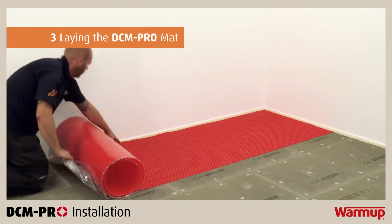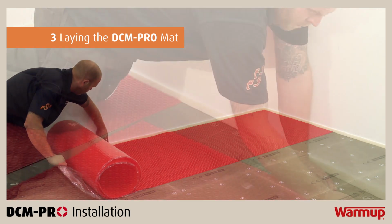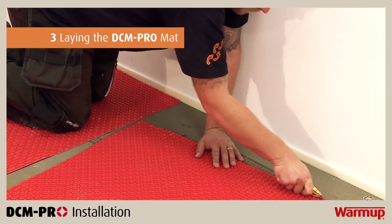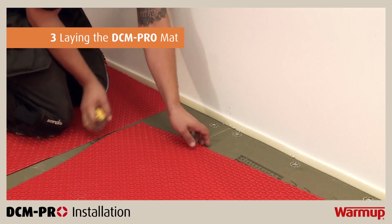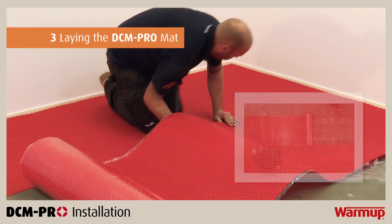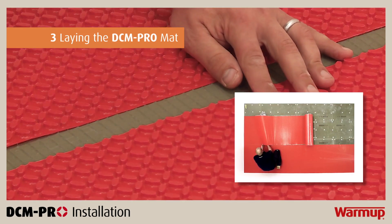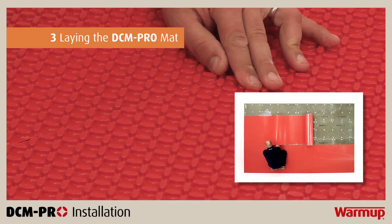When you reach a wall or a permanent structure, you will need to cut the membrane with either a utility knife or a pair of scissors. Take care when cutting the mat and try to make your cuts as straight as possible where you can. When laying subsequent runs of the mat, ensure that they are tightly butted up together and that the castellations of the mats are aligned.